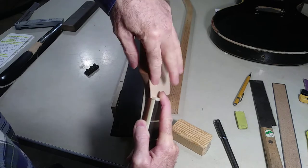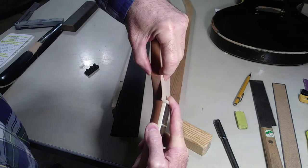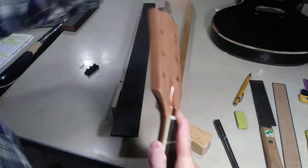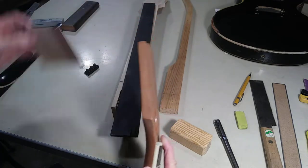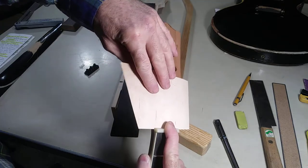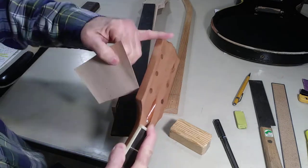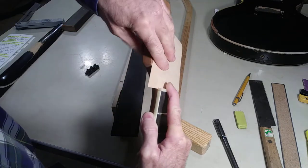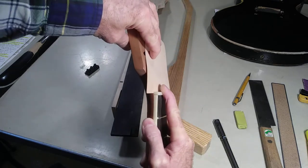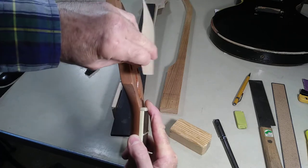I'm going to have an extremely thin veneer on this headstock because I'm already at 5/8 of an inch thick there, and I'm already 9/16 of an inch thick here. I have my traditional jazz guitar pitched headstock, and then I don't have an overlay. If anything, I could paint this. It's just going to be standard. It doesn't have binding. So you see how the engineering is completely different on this neck, because I don't have the thickness of the overlay.